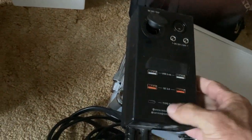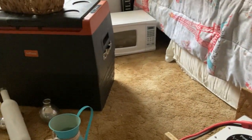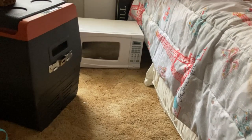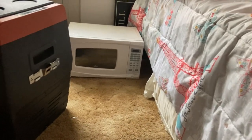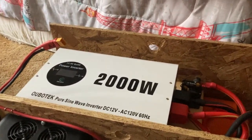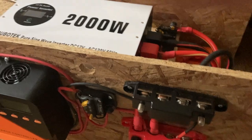This is just for auxiliary - it's for this box here, so I can hook this up. It's got the cigarette lighter plug and your USBs so I can run my refrigerator - a 12-volt refrigerator. This will easily run the 700-watt microwave - of course it uses 1100 watts to run - that 700-watt microwave over there. And I ran a hairdryer - 1500 watts - out of this guy last night for five minutes.